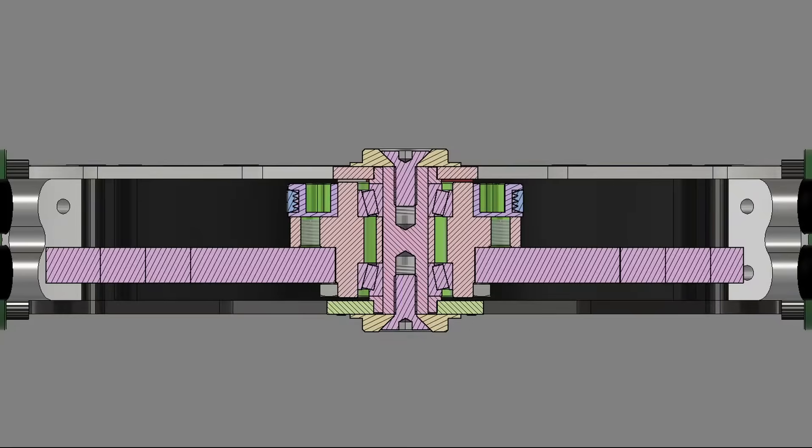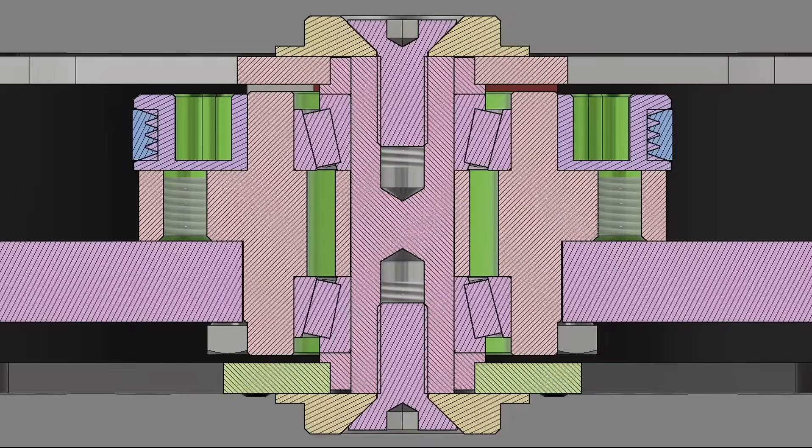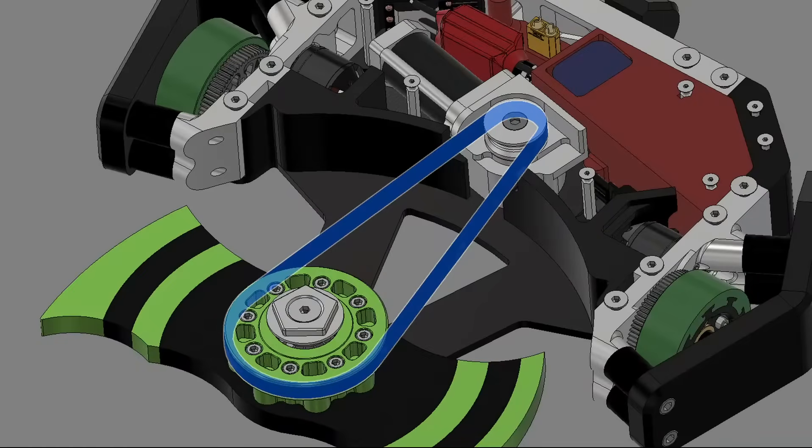As for the weapon system itself, it's quite similar to the original stack-up. Two tapered roller bearings support the hub with a pulley on one side and a bar on the other. These bearings need to be properly preloaded with set spacers top and bottom. Screws on either end of the weapon shaft will clamp the plates, shims, inner bearing races, and middle spacer together into one rigid stack. Assuming the heights are set correctly, the bearings can operate at their rated load capacity and make for an extremely durable weapon hub. Overall, the reduction from motor to weapon is 8.5 to 1, for 5200 RPM at the blade.